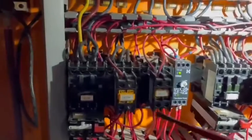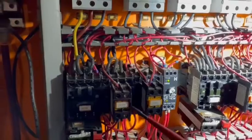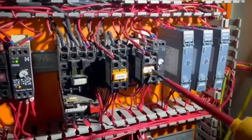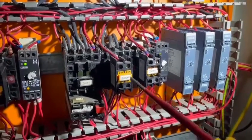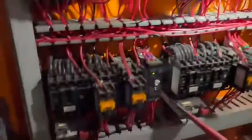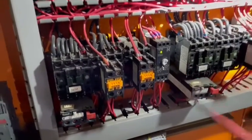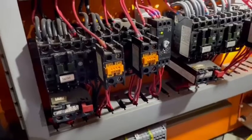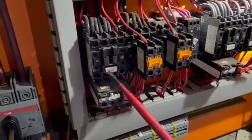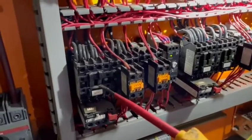As you can see, that's pulled in the main contactor and the star contactor. After a few seconds it's now brought in delta, which has now engaged this time switch, which has brought in the star and this contactor. After a few seconds it will then change over to delta. As you can see the coil is now live on this one, but nothing is happening — it's not pulling in the star, and neither is it pulling in the main contactor.